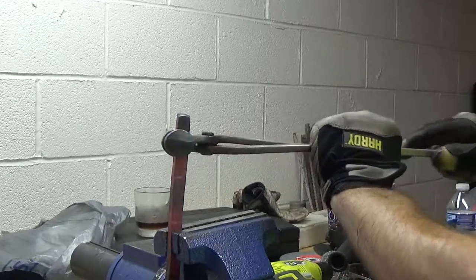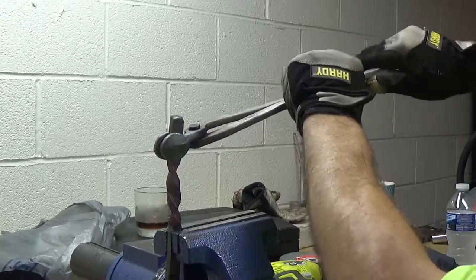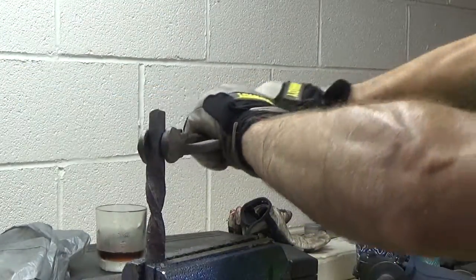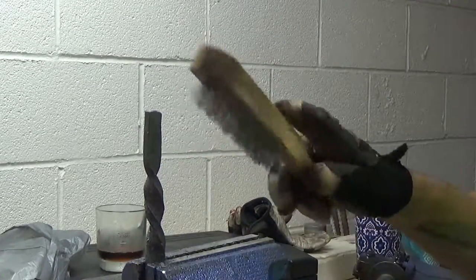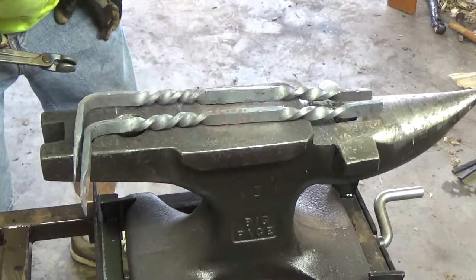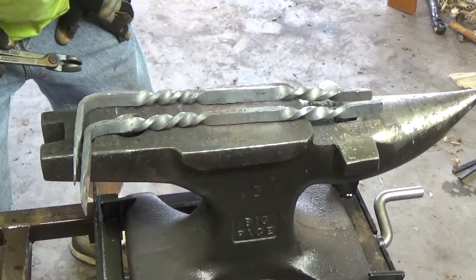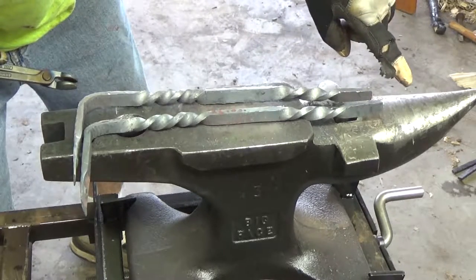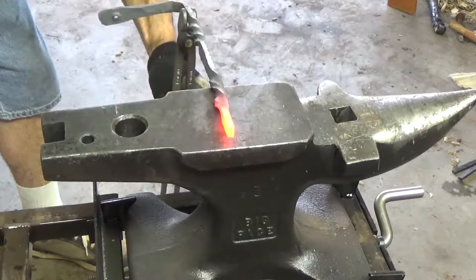Okay, we're going to put that top twist in — one full turn. And there it is. I've got to say I'm pretty happy with that, and I'm usually pretty critical of my own work. I was originally going to go with one twist, but the second twist seemed to be a good idea at the time and everything looks like it worked out. So I think to top everything off, what I'm going to do is taper out these points to a skinny taper and then maybe put a scroll on the end of those. I'm putting my tapers to a point.